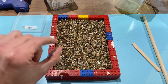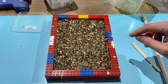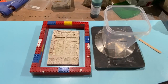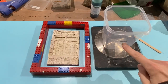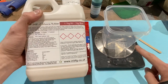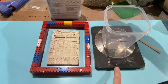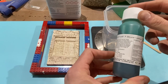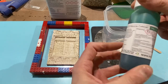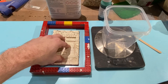I will mix it all up and pour it in - it should come to about the same level. This helps you gauge just how much silicone you need so you can avoid going over the top and wasting any, and also making sure you don't make the mould with too thin a bottom, because that can be problematic for keeping the mould stable. You also run the risk of tearing the bottom of the mould when you're using it if it's a little on the thin side. So I've tipped out all the gravel and I'm left with the fill line here, which is the minimum amount of silicone rubber I'm going to put into the mixing pot. I'm going to weigh it accurately and then top up with 10% catalyst - so make sure you read the instructions very carefully because you get one shot at mixing this. Once it's thoroughly mixed, I will pour it onto the mould.